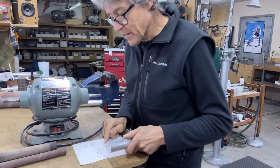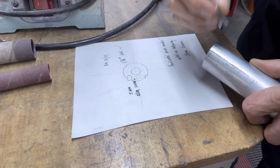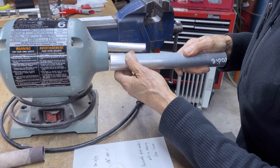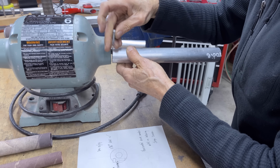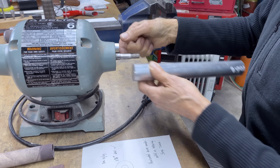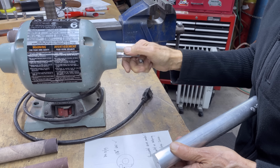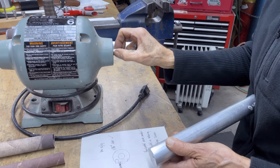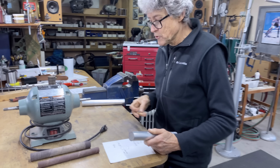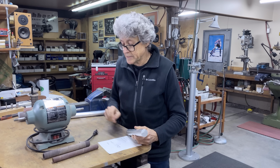It's going to be a clamping system. We're going to use a set screw. There's going to be a slot. This gets pressed onto here, well, installed, and then with a 4mm Allen key, we lock this onto here. These bores have to be quite spot on. So that's my job. Let's go over to the lathe. Let's take off some metal, and we'll continue.